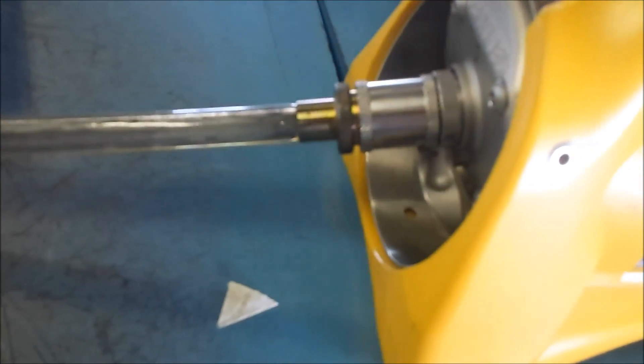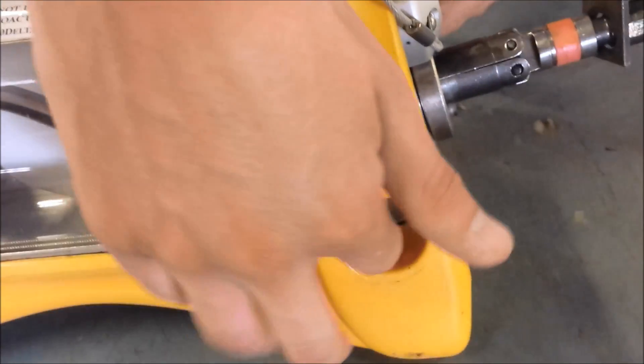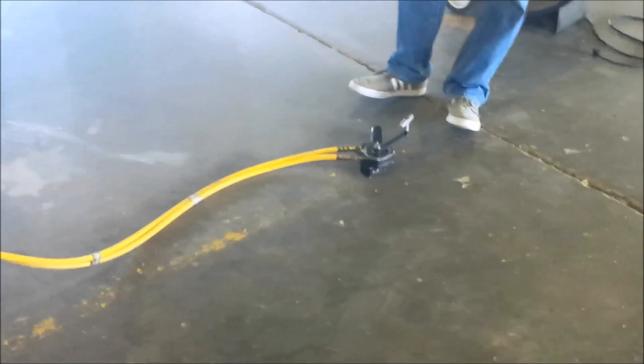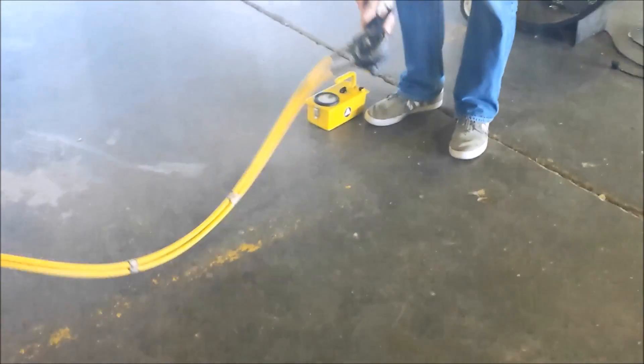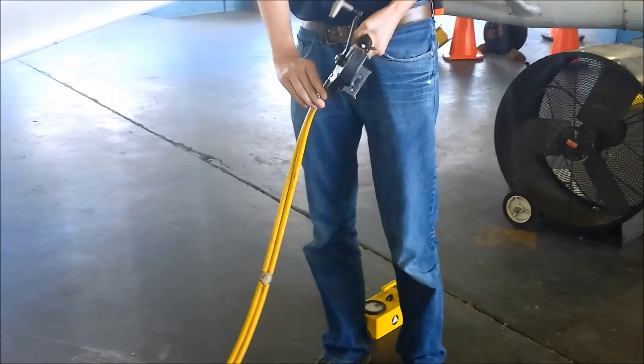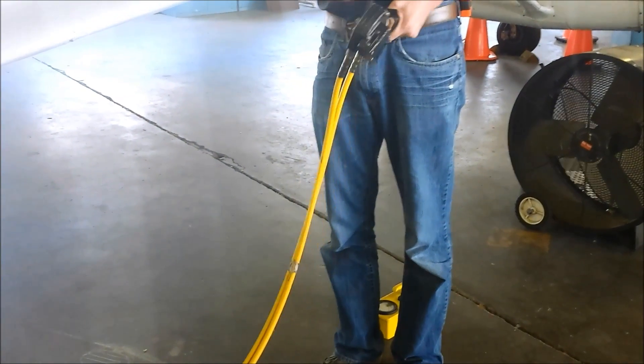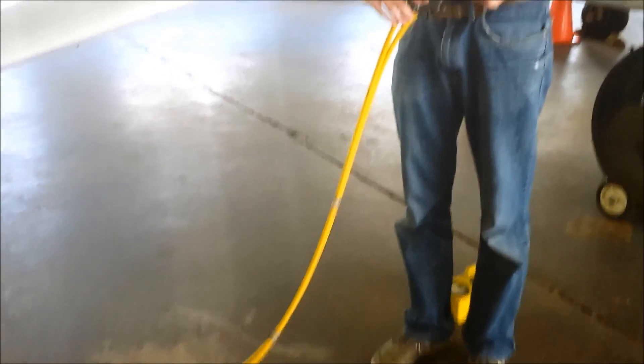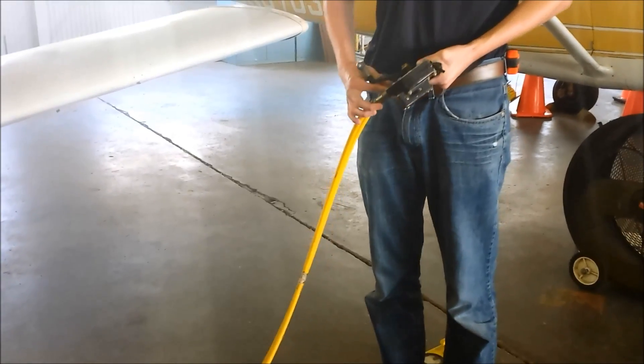Open the front door all the way and then open the back door. Grab your survey meter and walk out to your crank. Unlock the brake and then shout live source. Then crank the cable to expose the source. Put the brake back on and leave it out for the remaining amount of time for your exposure.